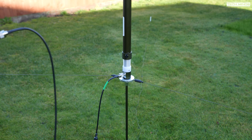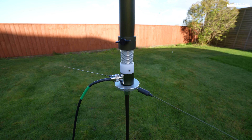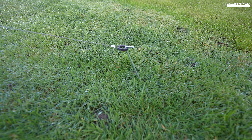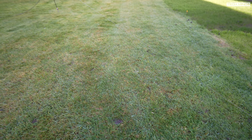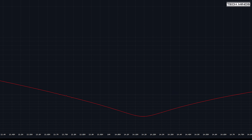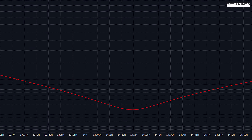The initial settings chart for a raised antenna shows that for 20 meters, I should have used just one counterpoise. However, I had attached two and it seemed to tune perfectly fine. The counterpoise wires are not touching the ground and are anchored at the tip of those tent pegs. From the nano VNA SWR reading, I was able to tune the antenna to an SWR of around 1.2 at 14.2 MHz, right in the middle of the 20 meter band. The band edges on 20 meters didn't go above 1.5, so the bandwidth covers the entire band — less retuning needed if you want to hop around frequencies.